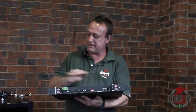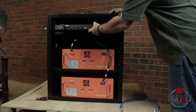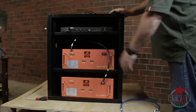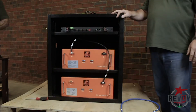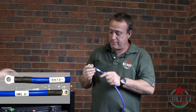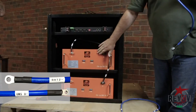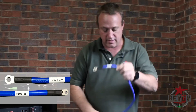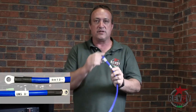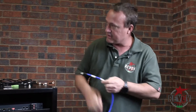We're going to install the BMS with the two batteries that are in the cabinet. We're going to put it in the top shelf like that. We are then going to take our battery cable for the negative, which is this blue cable over here. You'll see it's labeled — it's got 'Battery 2 Minus', this being battery 2 down here. We're going to connect it onto that connector there. The other side is marked 'BMS B Minus', which is this position on the BMS over here.